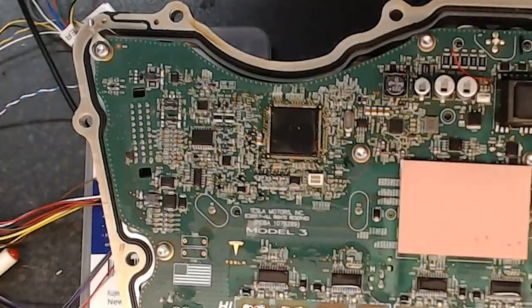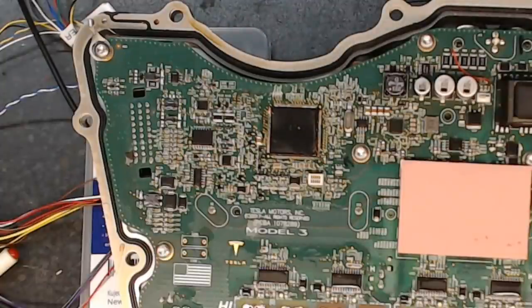Now, phase two, we are going to need some isopropyl alcohol and some cotton buds, because what I want to do is clean off around the area there. The reason we're going to clean off around the chip is that we have to remove, I guess, Elon's body here. We've cut off his limbs, thus protecting the precious pads.